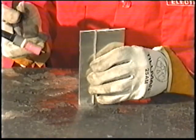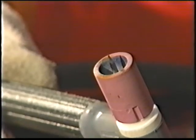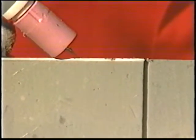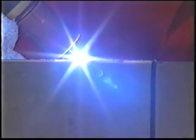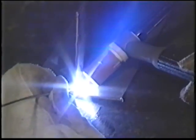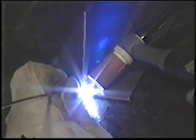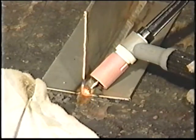Let's move up to TIG welding of stainless steel. The tungsten electrode must have a sharp, uncontaminated point, and the polarity remains at DC negative. The ceramic cup is positioned on the workpiece, the arc started, and precise circular motions fuse the two edges for a smooth, clean weld. Practice again on the lap weld with filler metal — don't forget to steel wool the filler rod first. For the stainless fillet weld, remember the steps: position the torch, use the foot control, circular motions, dabbing the filler rod in as needed, and pause to protect the weld puddle.